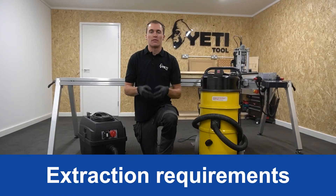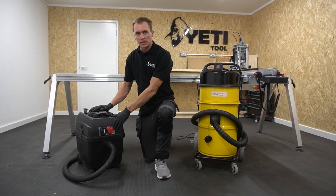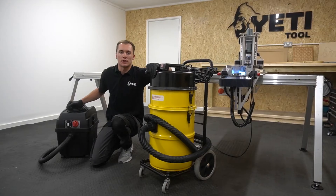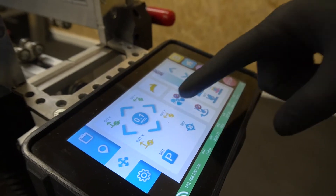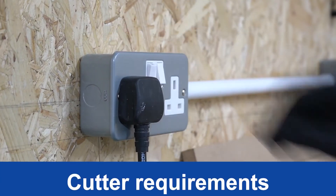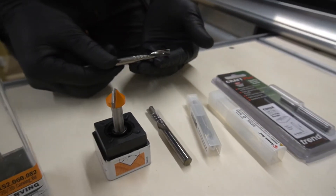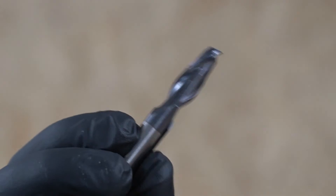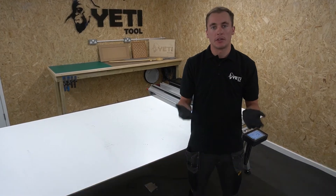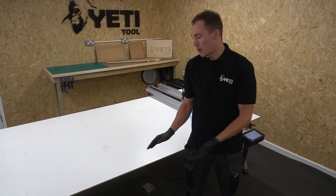It is very important to have a good extractor with good chip and dust extraction. You'll need a minimum flow rate of around 70 litres, but may need a more powerful extractor based on your material and application. If your extractor meets power specifications, SmartBench can start and stop it automatically; higher power requirements will need an external power source. Cutters come in a wide range of shapes and sizes and do not last forever, so discipline around replacing them is very important. A good spoil board needs to be rigid and flat — we'd recommend 9mm double melamine faced MDF.